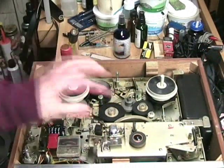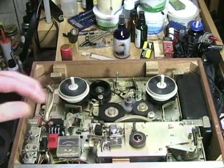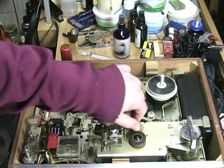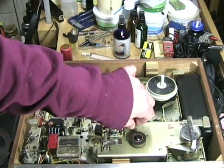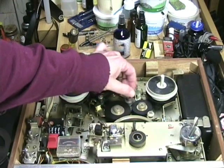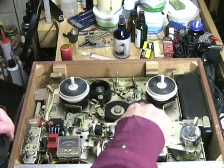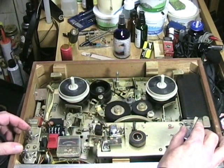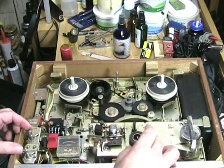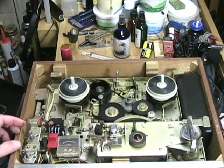I'm going to do some exploring to find out what is going on. The capstan can be lifted up quite a bit. When I lift it and spin it there's no noise, but when I put it into play I can turn the motor and it will turn the capstan, engaging the drive mechanism. But why it is not moving otherwise — we'll find out.